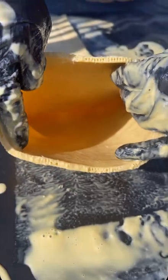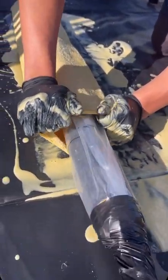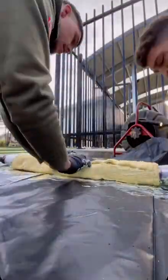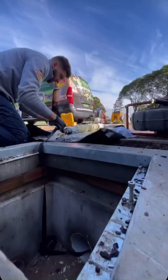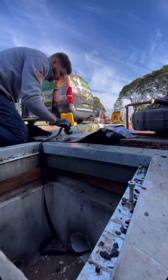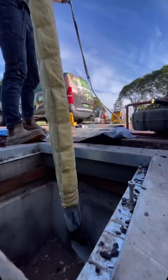We then check the liner to make sure we can't see any white spots, and then we slide our packer in. We attach some rubber bands ensuring that our liner stays in place on our packer, and attach a pull point — this is going to help us get it into place in the drain using a pull and push technique.